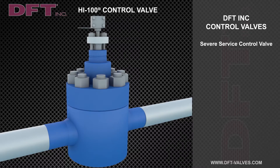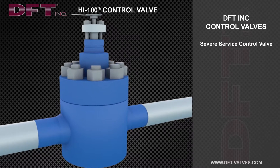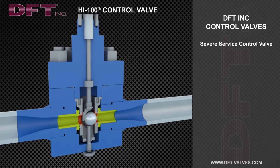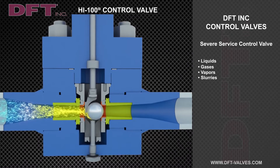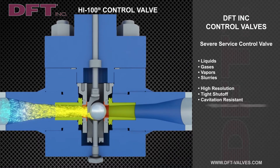It features an in-line straight-through Venturi flow design, which is cavitation-resistant. Here you see fluid from the pump filling the pipe with the Hi 100 in the closed position, showing the Class 5 tight shutoff. The Hi 100 features ANSI FCI 70-2 Class 5 metal-to-metal tight shutoff as standard.